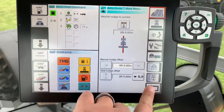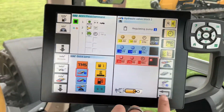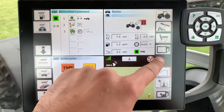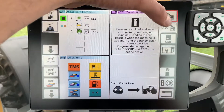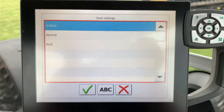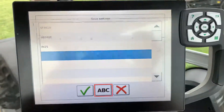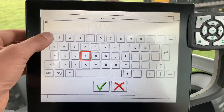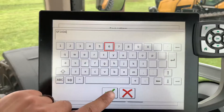Let's say I liked what I had in there already for my in-and-go and hydraulics. I'm going to go to home and click on what looks like a little ISOBUS terminal — the vario terminal. Click on that, click it again. Now I want to save this, so I'll click on the ABC button, click on a blank spot, hit ABC, and type 'SF 1436' — or you can call it 'disc' or whatever you want, whatever you're pulling. Hit the check mark.